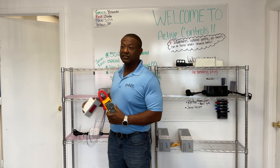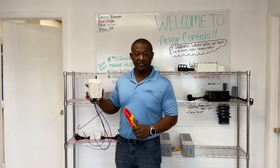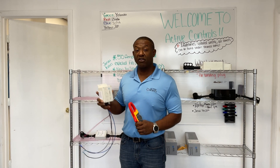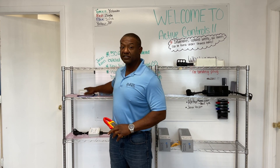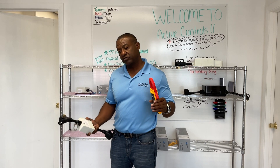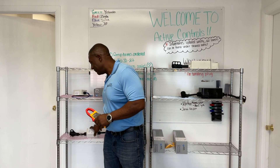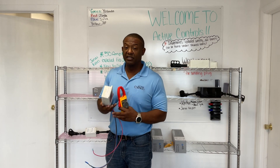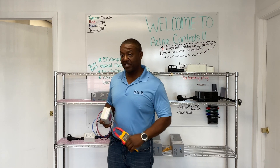Our wired product, as you know, gets 80% reduction and is the best — especially what you're going to see in other videos with our unit starting on solar generators or inverters. That's where it is the best. This product, ideally, some people have had success with inverters and solar generators, but it depends on the load and how much headroom you have on the inverter, since we're getting up to 50% reduction. The wired product gets 80% peak reduction, and even higher when you look at it with Inrush current measured integrated over time — we're seeing 85 to 86% reduction in Inrush current.